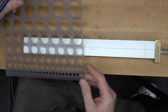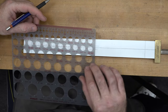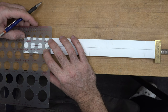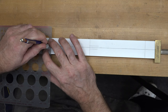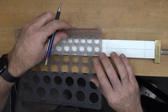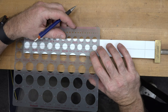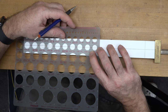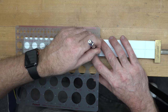For the key hole we're going to take a circle template — a half-inch template — line it up with that edge line and with our center line, which we put on there for reference, and draw a half-inch hole. That becomes our female receptacle for our tracks. We do the exact same thing on this side, lining it up with the center line and with the nine thirty-seconds mark, and draw another half-inch hole.